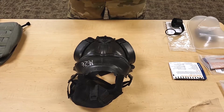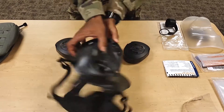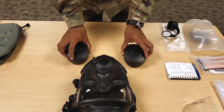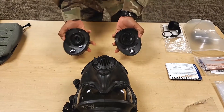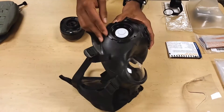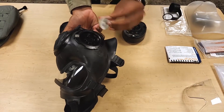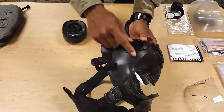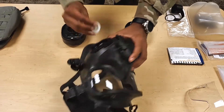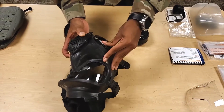Item number seven. Remove the M61 filters from the filter mounts, and visually inspect the filter mounts for a tight fit and damage. Visually inspect the serial number and lot on the filter mount to ensure they are readable. Visually inspect the barcode to ensure it is readable. Remove the self-sealing disc valves, and visually inspect for damage or deterioration. Inspect the self-sealing valve seat and valve mounting post for damage. Reinstall the self-sealing disc valves, and inspect for proper operation by pressing down firmly on the center of the valve. The disc valve should pop open and then close when pressure is removed.